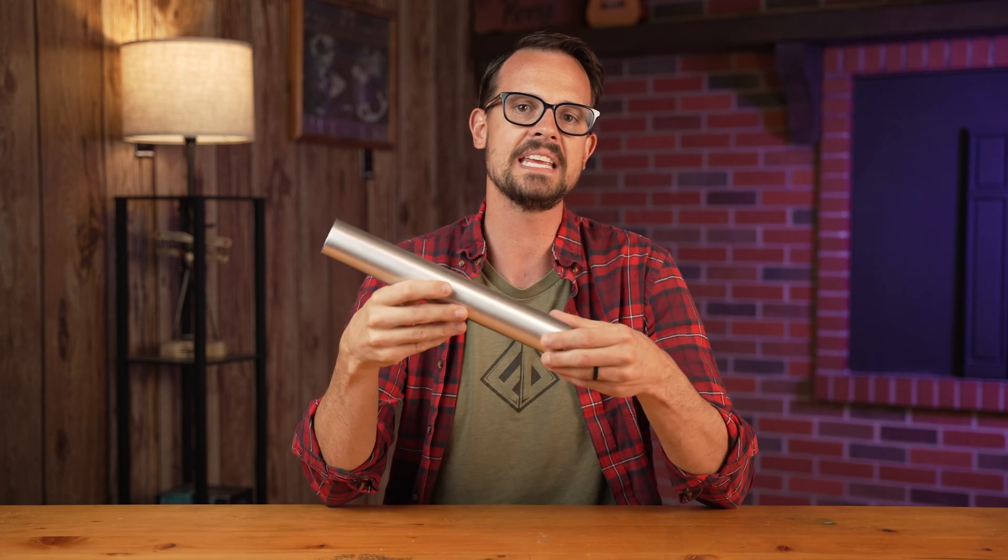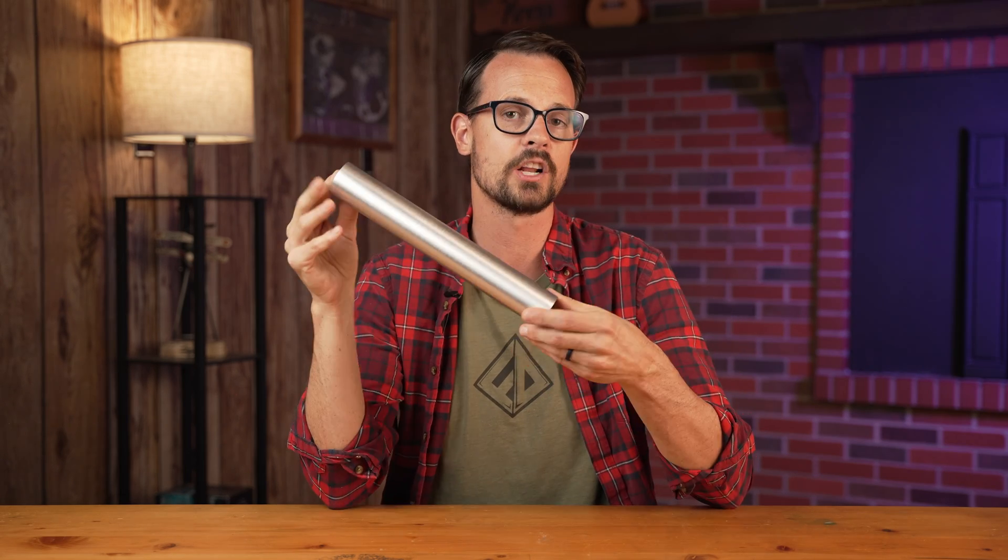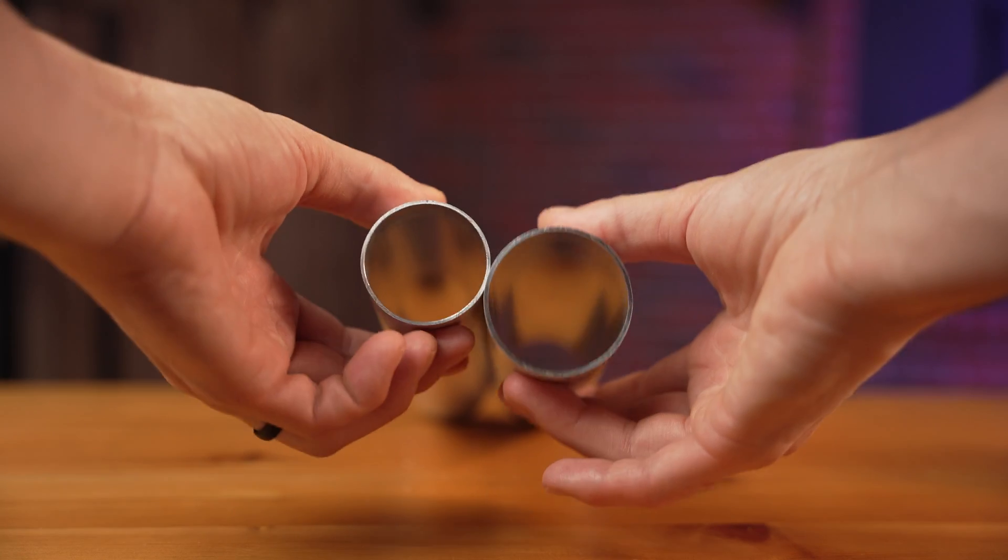In both of these cases, using a cylindrical housing filled with desiccant would work perfectly. The easiest would be to 3D print a cylinder to put the desiccant into, but when you go to put it in the oven to recharge it, it would melt, which means you have to take the beads out first, so it's not really an easy permanent solution. Instead, I think aluminum is a better way to go.